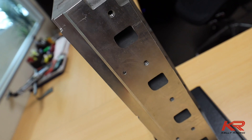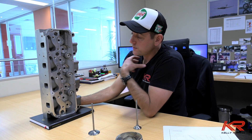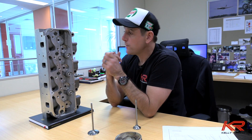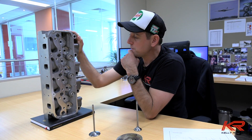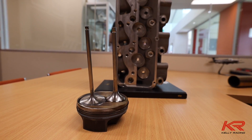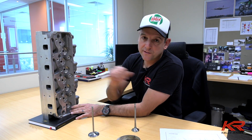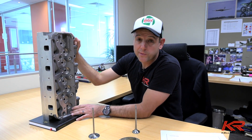You can see behind me on the screen an example of our internal surface of the inlet port and the exhaust port. You need to be careful that the design and positioning doesn't break through into any of the internal water jackets. It sounds scary, but you can get within two millimeters wall thickness of your port to water jacket. Once all of those things are optimized, we can then go ahead and design the exhaust system and manifold. That process has been done - the manifold is actually getting machined at the moment and our cylinder heads are probably only a week away from landing in the country.